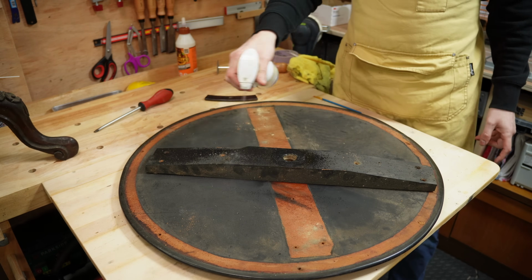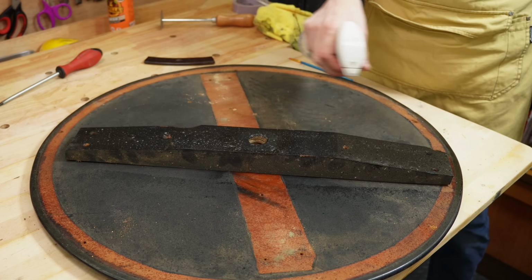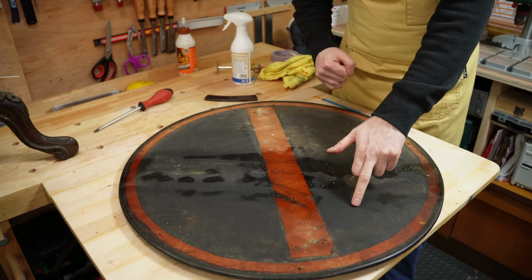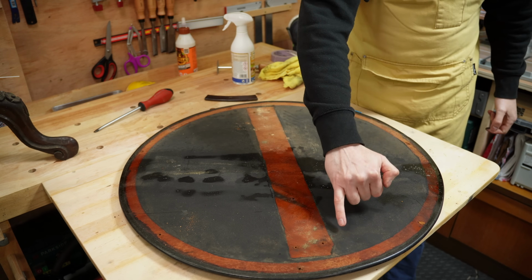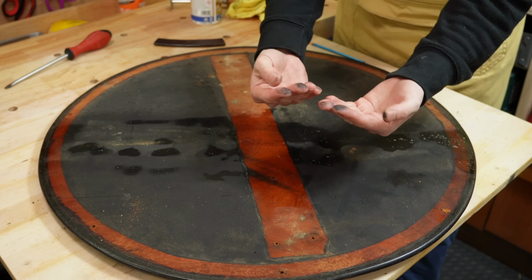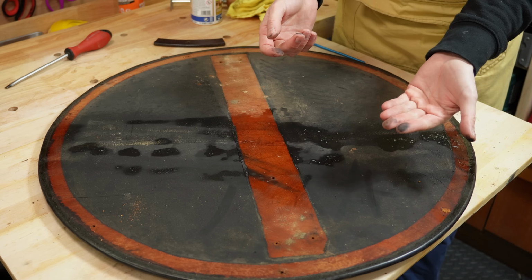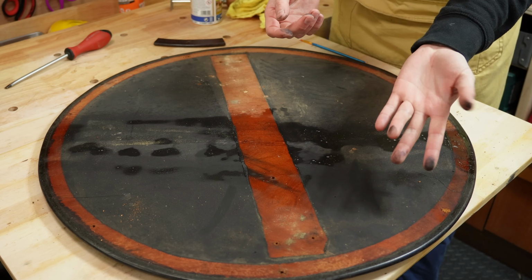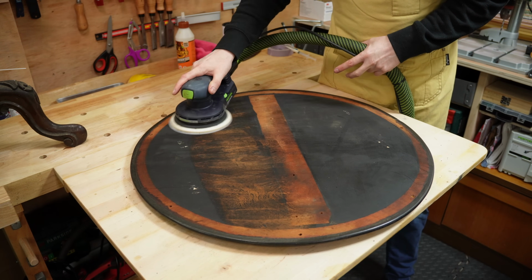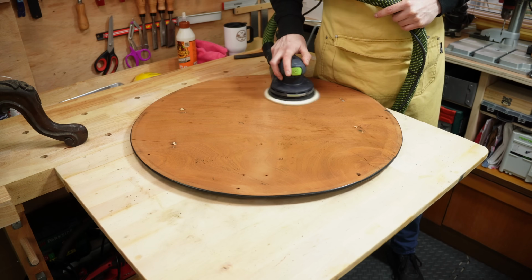I used my woodworm treatment spray for this piece, which I believe is elm, and as far as I know, this is something that woodworm really likes, so possibly that's why this is the only bit affected. This is what I believe to be soot, and this is something that people used to collect from candles and lamps, and they would mix it with animal fat and use it for ink and wood stain. As you can see, this is coming off very easily, so this would transfer onto your clothes and your fingers, so it had to go.